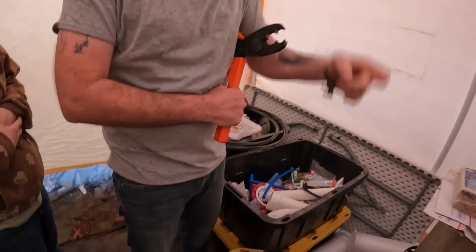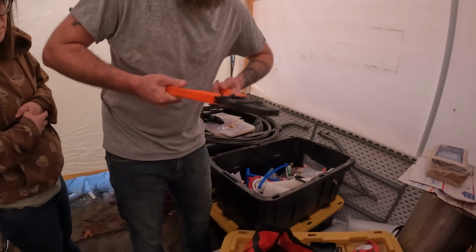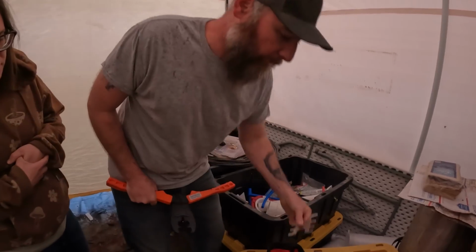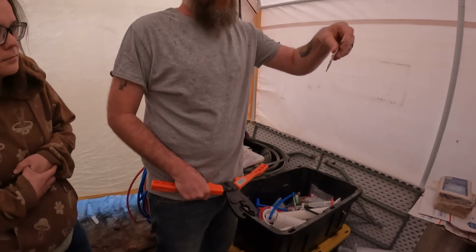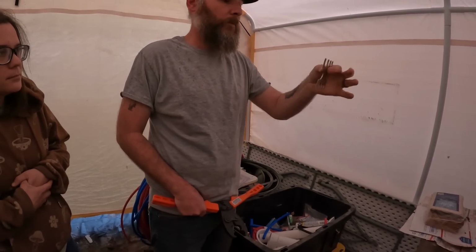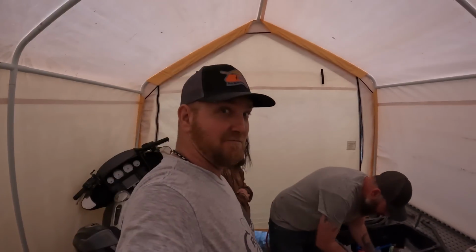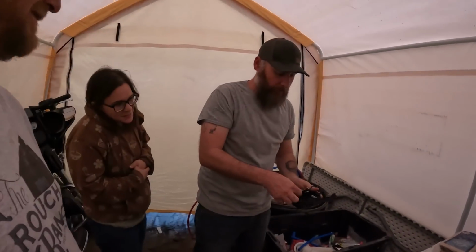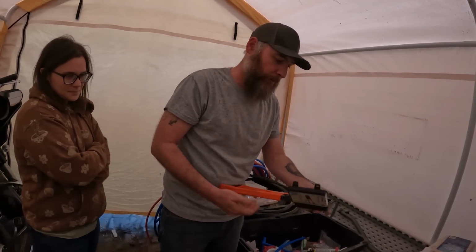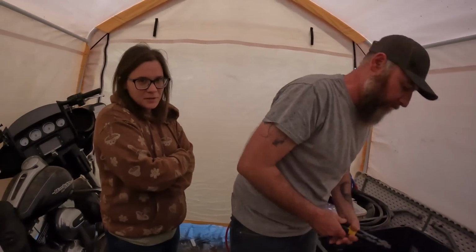All right. So you'll put it on, 1/2 inch to 1/4, and crimp it all the way down like that. Pull it off. You know what I'm talking about when I say that, right? And then just grab this on every one and check it. If you can put it over the no-go, it's no good. You should only be able to put it over on the go. We ain't got no time for no-goes. Well, you'd be surprised. You get one crooked on accident, and you'll be moving along too, and it could be. That's why I say make sure you check, and then down the line.